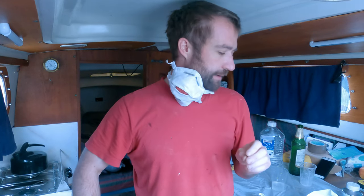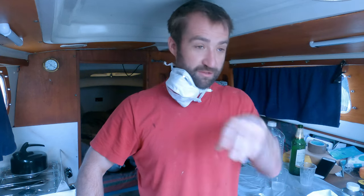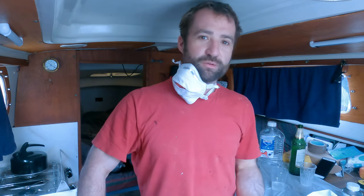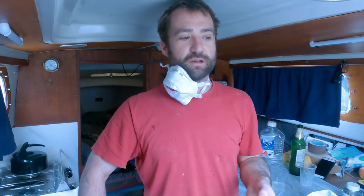The fiberglass thing is now complete and I'm much happier with how the second round has come out. I managed to drill some holes into the voids and that little pot of powder — which I didn't know what it was yesterday — is essentially just ground up fiberglass. I mixed a load of that with some epoxy and basically injected it into each of the voids, which did a really good job of filling them all in. Then I put another decent layer of fiberglass on it — no bubbles now because it's quite rounded off. Apart from being a day behind schedule because I've got to wait another day for that to dry before I can get in there and paint and start doing the electrics, I'm much happier with how it's come out. Lesson for you: if you're going to do fiberglass for the first time, grab a couple of little bits of wood and have a practice.